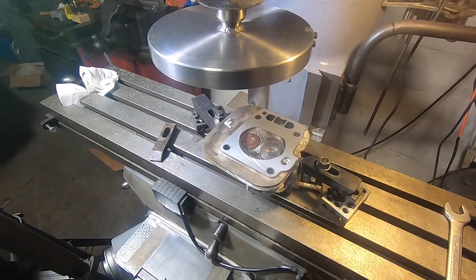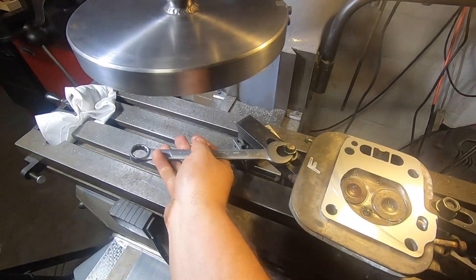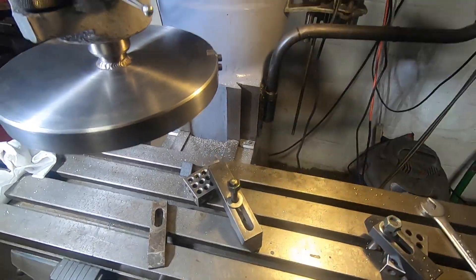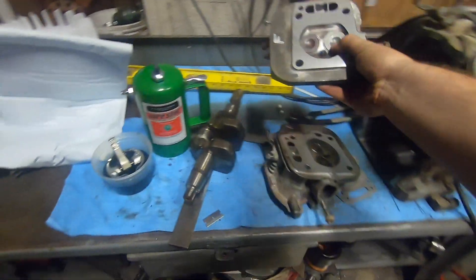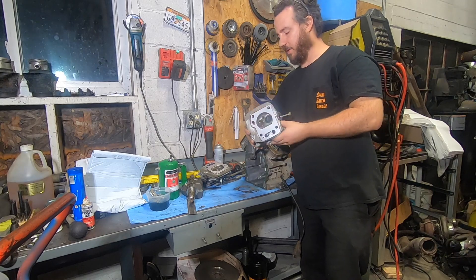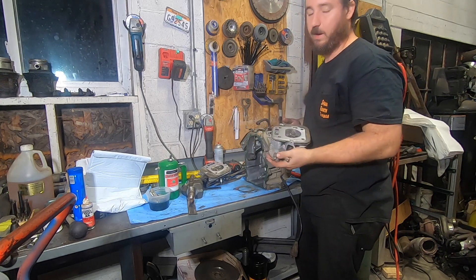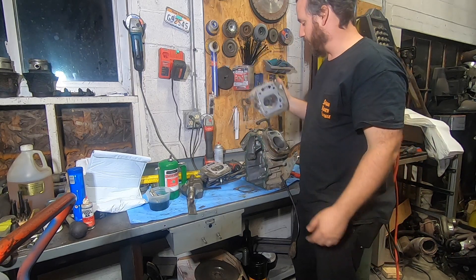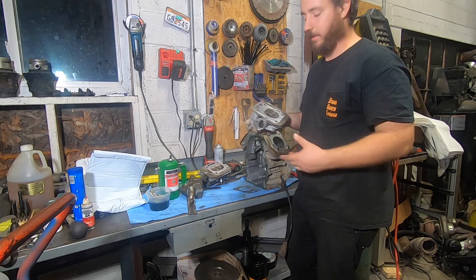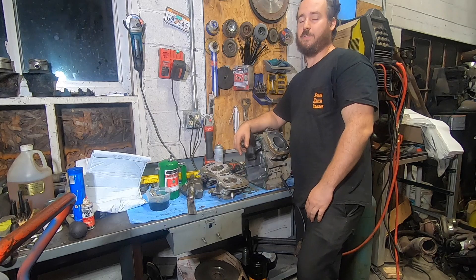Plenty smooth for the metal gasket the Honda has on this engine. Super simple fixturing on these Hondas because the back side is parallel, so if your table is trammed in, everything's good and clean — it's literally just clamp it down and go cut it. There we are: two resurfaced cylinder heads ready to go on this perfectly clean engine block. Probably took 40 minutes from start to finish including filming. If you do this stuff daily you could probably bang this pair out in 20 minutes. If you have the means to, it's absolutely worth cutting the heads on these V-twins and probably the single cylinders. I guarantee there will be no leaks in the future for this engine. Thanks for watching Side Job Saturdays on Spank Ranch Garage.